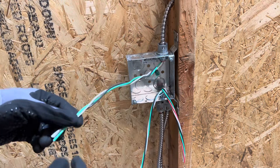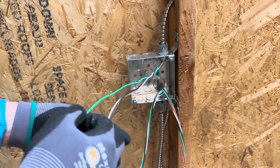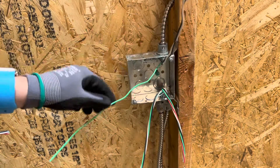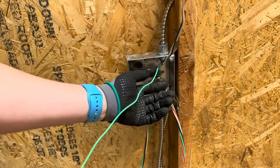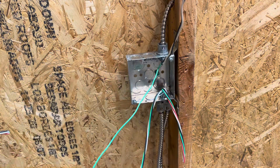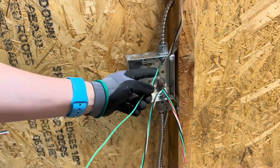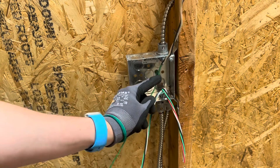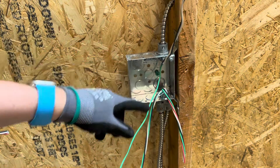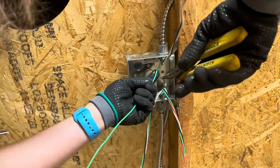Once you do that, take one of your wires — take the longest one. If you don't have a pigtail you can make one: strip it out, crimp it, and tighten it. With this method you'll have one less wire in your wire nut bunch for grounds. Take your wire strippers and crimp it right where it comes in. It really depends on where your wire is coming from relative to where your ground screw is, but I like to crimp it when it comes in, so I'll go down to my 14.